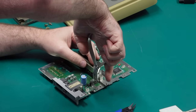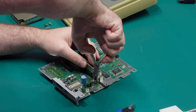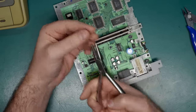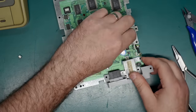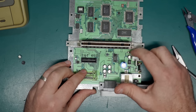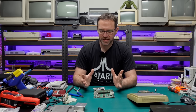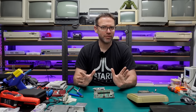The final method and the one that I prefer is the twist method: coming in on top of the capacitor and gently pushing down while twisting back and forth — not too much, just a slight bit either way — until you feel the legs break and then the capacitor comes off. Then you just need to remove the black plastic part if it's still there and clean up the pads and remove the broken off legs. I've had the most success doing it this way — in fact I've never lifted a pad doing it this way.